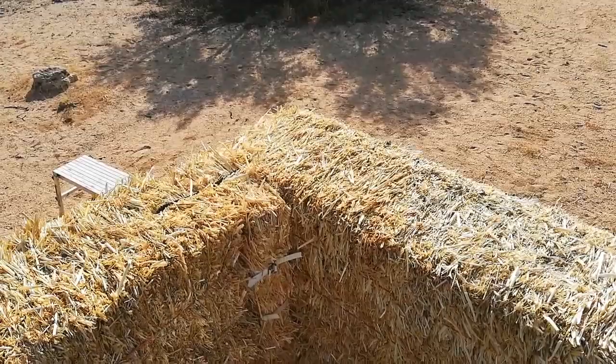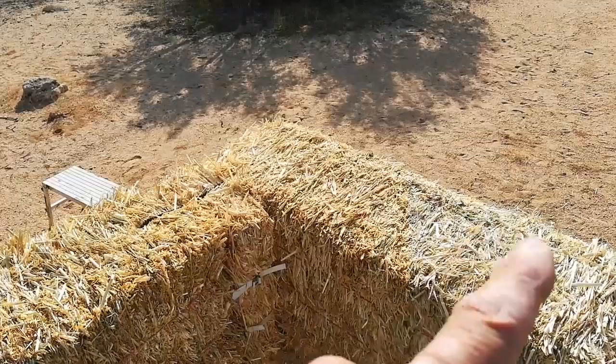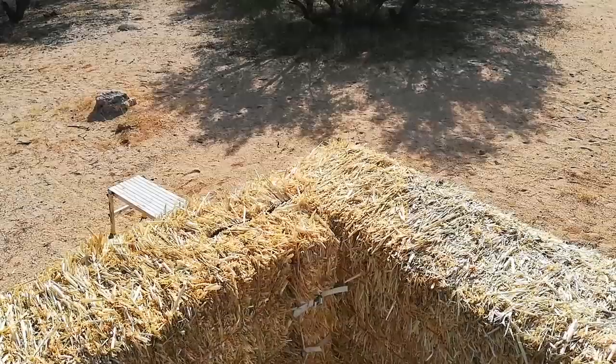What we're going to be doing is using two 2x6s running parallel with a piece of half-inch OSB nailed on top. That is sort of considered a medium rigid box beam, and for our build will be more than sufficient in terms of strength and is very cost effective as well. So let's get over and start cutting some wood.